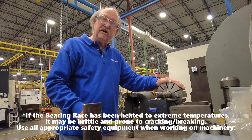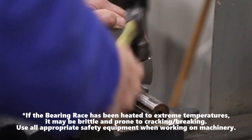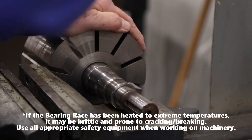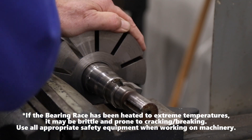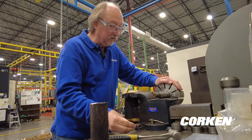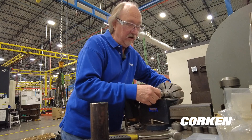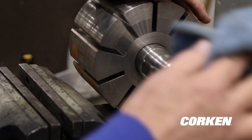We're going to have to hit this a few times to get it to start cracking. In this case, instead of flattening it, it actually broke the race — but it still effectively does the same thing. Once we get that off, I did hit the shaft here a little bit, but it's not up in the area enough to hurt it.